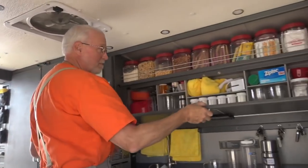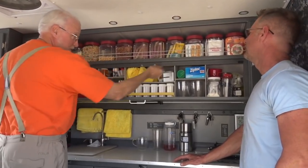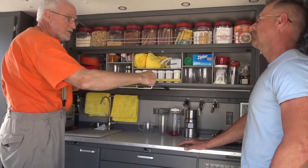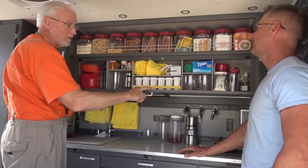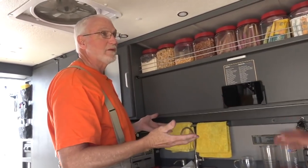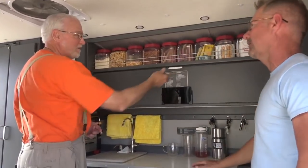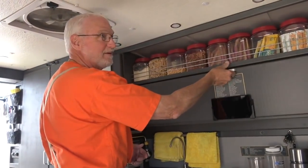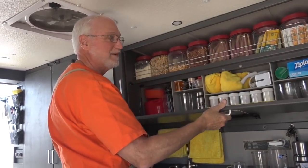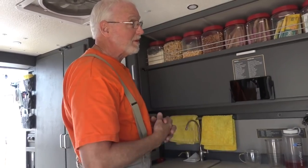The catch is these are embedded cup magnets embedded down into this birch rail. And the handle screws are reinforced on the inside with magnetic steel washers. The magnetic steel washers are lined up with the cup magnets. You have to pull it — it's not going to come off on a washboard road. But you can use your thumb and just pop it open and it stays. Then you close it and it's solid. But I tend to go on some bumpy roads, so there's also a catch so that if it comes open, it won't drop.